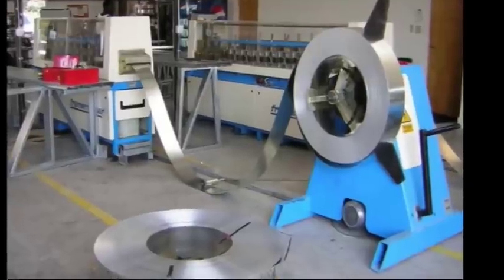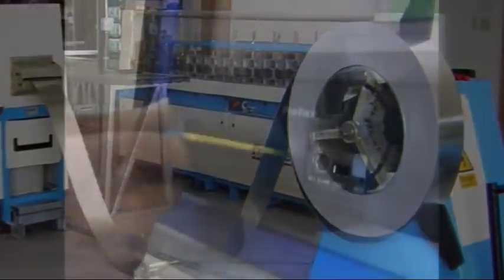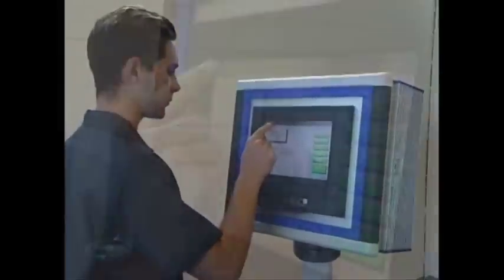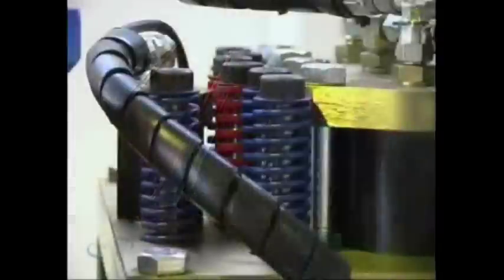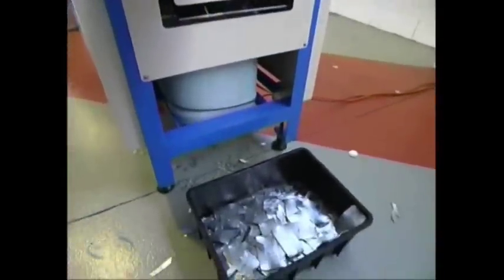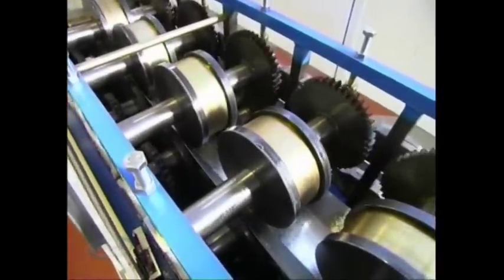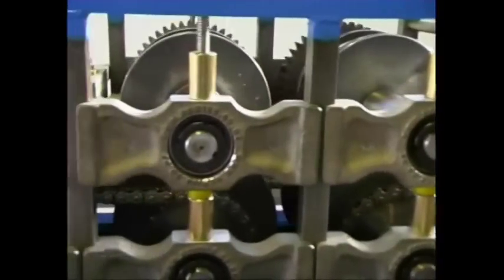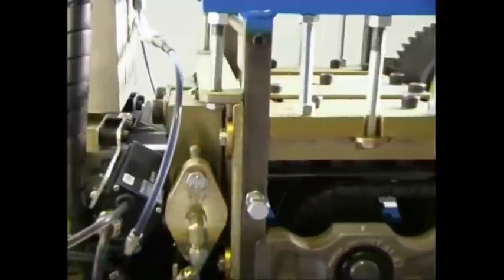The steel is loaded onto a device called a decoiler, and the operator uploads the Deck-on-Steel controller with the final data and starts the manufacturing process. The steel is fed into the machine and continuously folded into a standard structural profile in a process called cold roll forming. As the steel takes shape, it is also manipulated so that features of the Deck-on-Steel framing system — like snap-in decking slots, continuous bridge members, and pre-set fastener holes — are integrated into the components as specified by the design.